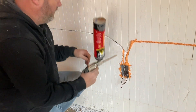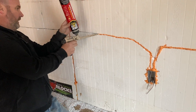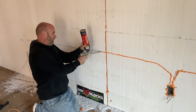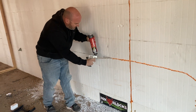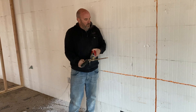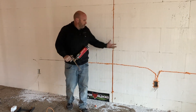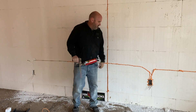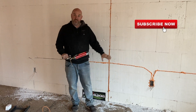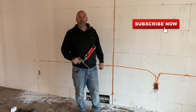We will remove all the excess with a box knife — it takes like two seconds. But this is what's going to hold that wire back into the wall. It kind of stays on its own, but this is your belt and suspenders. This is the fail-safe that protects the wire, keeps it enclosed. So we just do that to the next one, go around that box. Most of the time the electricians will do the entire house and just do this all at once — it takes them like an hour to run through a normal-size house and foam it all up. You just take a rasp or a screwdriver and knock off all the excess foam. That's it guys. That is effectively ready for sheet rock. Do that to the whole house and you've got a fortress — and that's how you run wire in ICF.